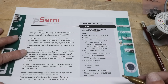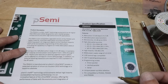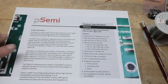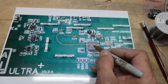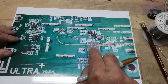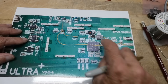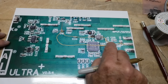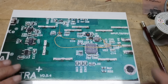So they're kind of cheating there above four gigahertz. That step attenuator is an upgrade from the older SAs — this is a different part. The signal can either go through the attenuator path to be divided down, or it can go the other path through an LNA — a ~20 dB low noise amplifier. If you need more gain, you go that way; if you need less, you go through the attenuator. Then a switch picks which path and the signal continues up to the rest of the circuit.